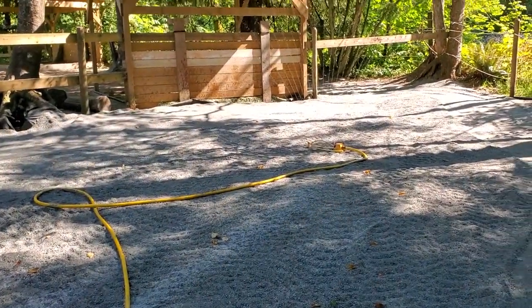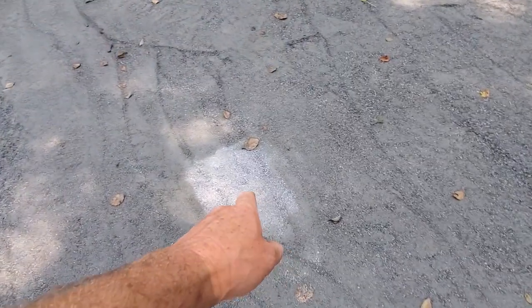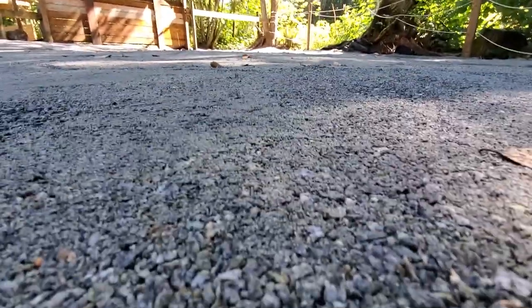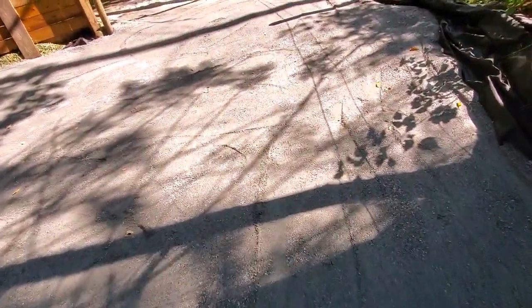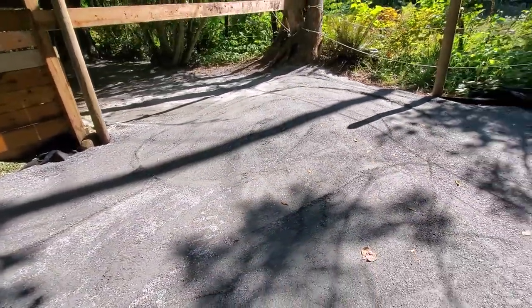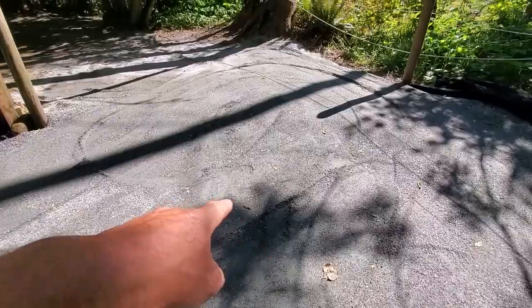That's just the short little sprinkler bit, and that's all done. So you can see I never got water where the compactor was sitting, but the rest of it is. That's what it looks like down low — there's no give to it anymore, nothing at all, you can walk it. I recommend doing two or three passes for sure. And the other thing to think about is that you'll start to find low spots, just somewhere where it was a little softer.